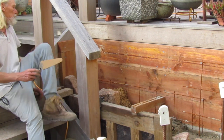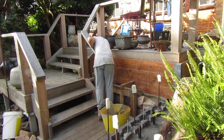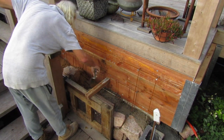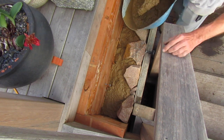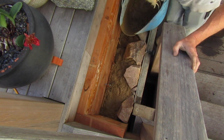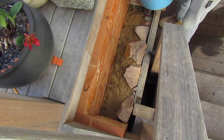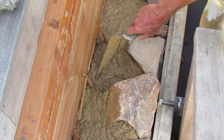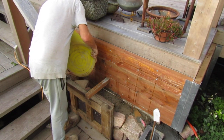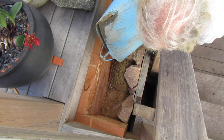We're starting in the left hand corner of the wall. We've already laid out some blocks and now we're backfilling with our pigmented concrete. We're continuing the same process from the earlier episode where we backfill the stone and thoroughly agitate it with our trowel to get a really good adhesion between the stone and the previous layer of concrete. I try to make sure we thoroughly fill all the gaps between the stone and work the concrete deeply into these cracks. We continue to add new stones and backfill them as we work our way along the wall, taking extra care when adding more concrete so we don't bump these stones out of alignment.